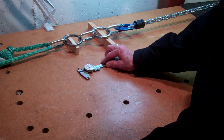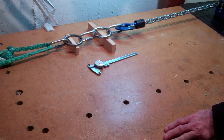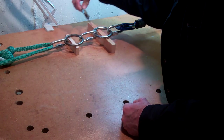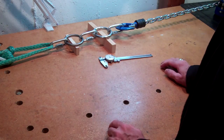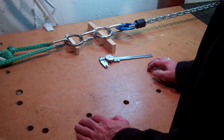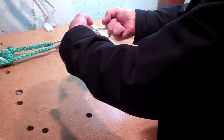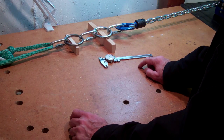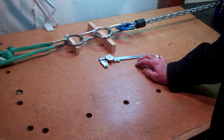That's the shade tree mechanic approach. I'll start cranking this up a couple of clicks at a time, make each measurement, record it, and plot it out. If that curve is a straight line — good news. If it's not a straight line, that says one of these rings is straining more than it should be, changing length more than expected, which is a telltale sign it's getting near a yield point. I'll post the data elsewhere.